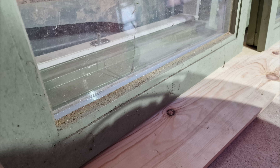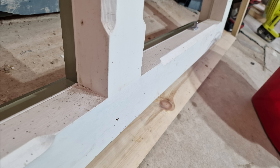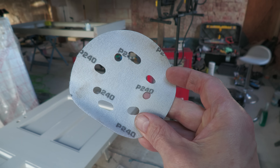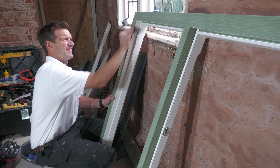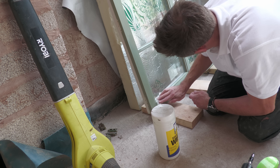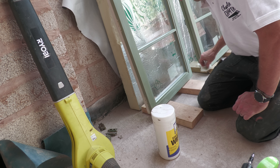There was a little bit of work to do before I could get started. The windows were covered in dust, grime and — who knows — possibly also a bit of bat excrement, so I hit them with a bucket of warm water and some sugar soap. I then decided to give the gloss surface a light sand, because although it's not necessary I wanted to give the paint every possible chance of adhering well to that surface. After all this, a final wipe down with some sugar soap wipes just to remove any dust and remaining grease, and I was ready to get painting.